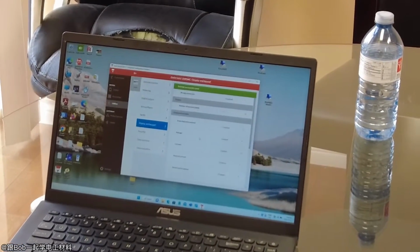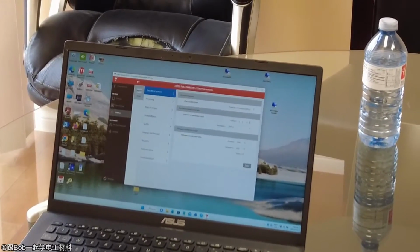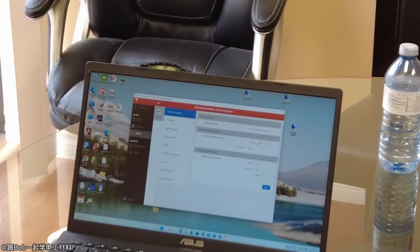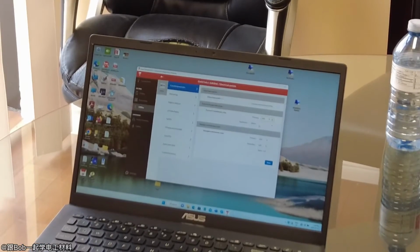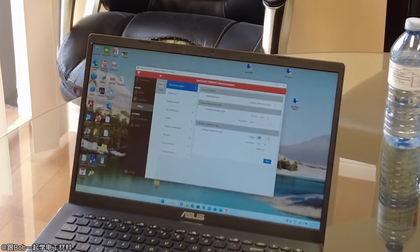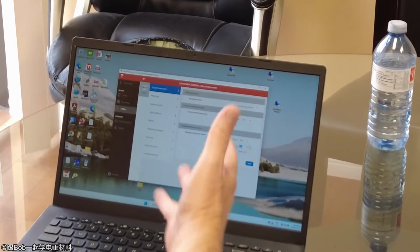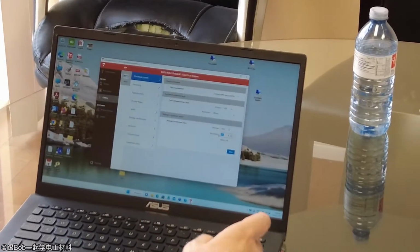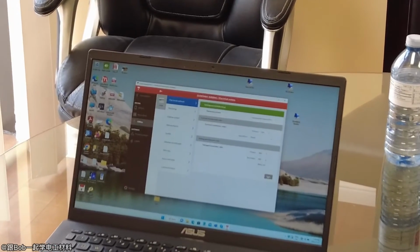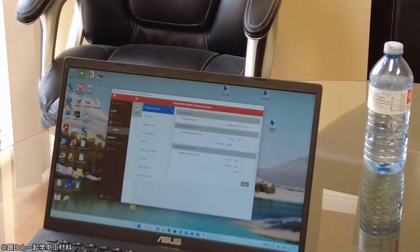It hasn't saved it to the meter, it's just saving it on the desktop here. The electrical system: the primary was 200 amps, the secondary is 80 milliamp. Voltage transformer, I'm just going to change that to 400. If you're using it on 220, you can keep it at 220, it doesn't really matter, but usually I just put it at 400. Save. As long as we don't use this PT transformer, just keep it at 400 all the time. Yeah, exactly.